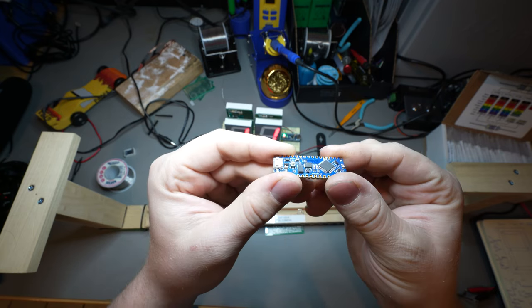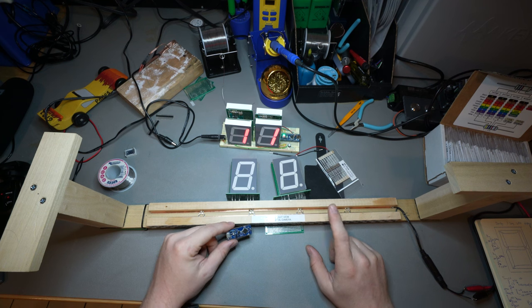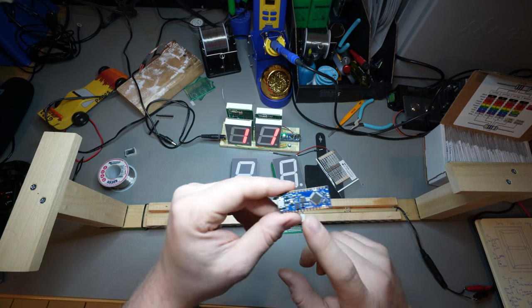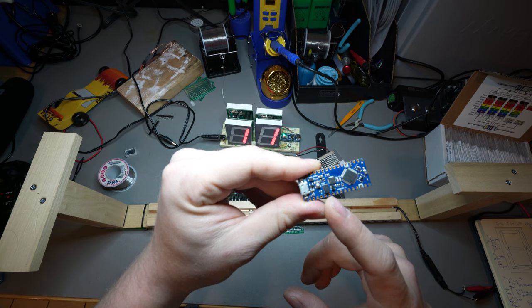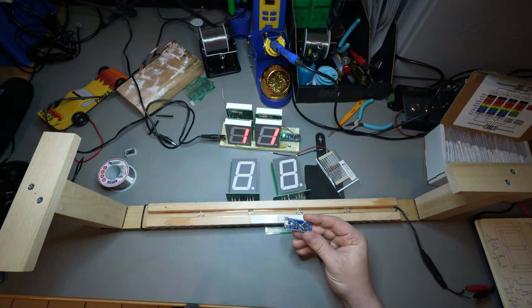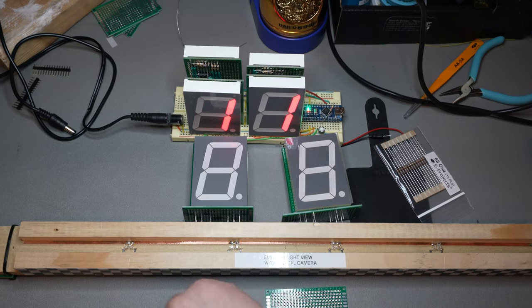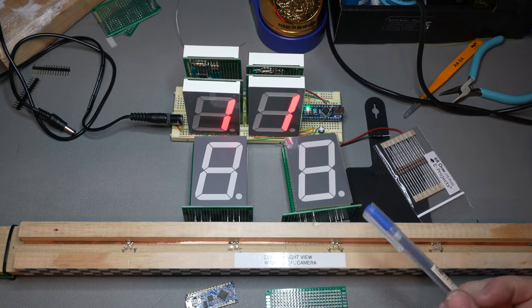But the 5-volt rail can do 950 milliamps, so if I convert this to still be doing about half an amp, then the 5-volt rail from the regulator on here should be able to easily power 500 milliamps. We want to convert this not to 12 volts, but maybe 5 volts now, so we can do it off of the voltage rail on the Nano.